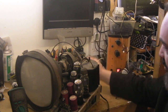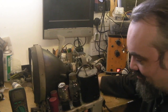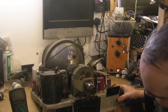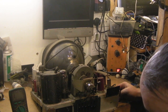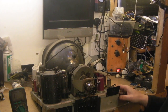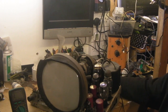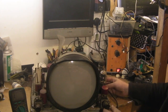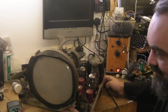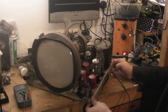Other things we need to do — let's just double-check that the mains voltage is actually set to the correct voltage. When these sets were made there were many different mains voltages in the UK. This set can actually run on 230, 240, or 250 volts. It is set currently in the 240-volt position, and I know that the mains coming out of my socket generally runs between about 238 and 241 volts, so the 240-volt setting on the selector is exactly correct.